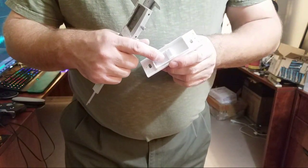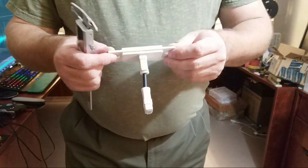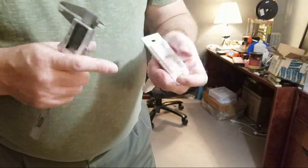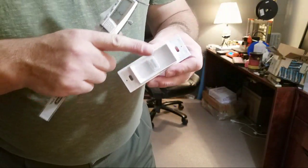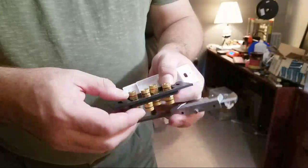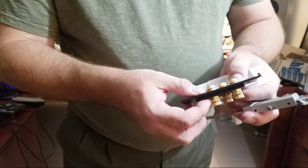The other measurement I needed to be concerned with was the thickness for rigidity - so this is like 3.3, somewhere around there - that's the value I entered for the thickness of the plate itself. Then the other part was where the nut connects on to the back of the audio connector for the banana plug. I needed to make sure I had enough threads, so I had to measure that height there. That was the thickness of this inner part - but this inner part I actually had protrude through so it was flush with the cover plate. I made sure I had enough clearance for the threads for the nut.